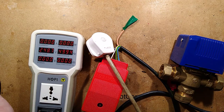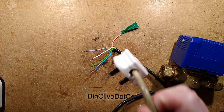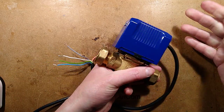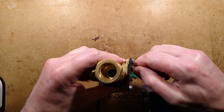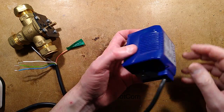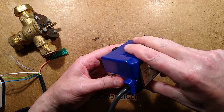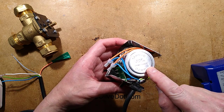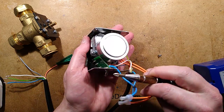Let's open it, because it achieves control in some clever ways that were cost-optimised when Honeywell were coming up with the system. To service this, you can just generally clip the top off. What you're left with is the diverter valve with its little stem — it's keyed so it can only go on one direction, and you can flop that backwards and forwards. This unit then has a screw that comes out at this side to reveal the motor inside. Samwoo motor — it's a standard synchronous motor. You can get replacement motors for these, but sometimes it's better just to change the whole head to save time.